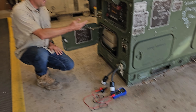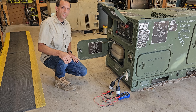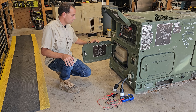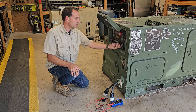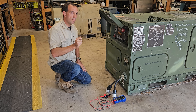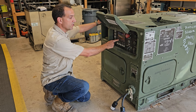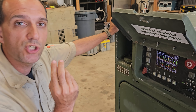P90 is down in there. Basically what they said to check is to take a multimeter and make sure you see some DC voltage there when the engine is at around 600 RPM. Just as the engine started to idle up is when I saw the voltage. I don't know if that's proper, but then when I plugged it back in, what I was trying to show earlier happened again. So the engine starts fine. When it starts to ramp up you can hear it trying to excite — it whines and causes the engine to struggle. Right now it's not trying to excite, there's no voltage, but as soon as it ramps up you'll see the voltage and hear a whine.